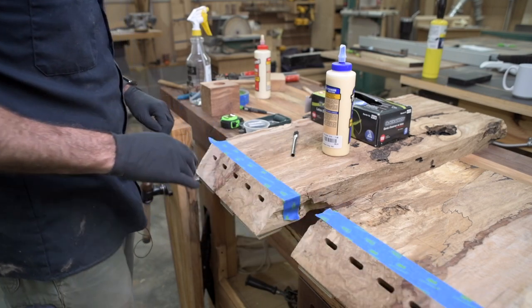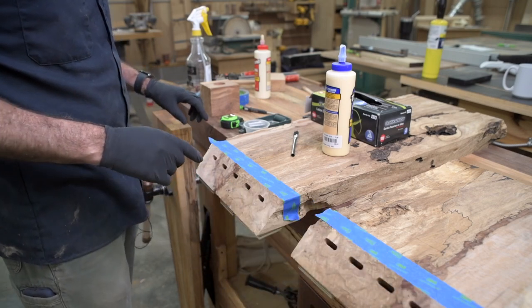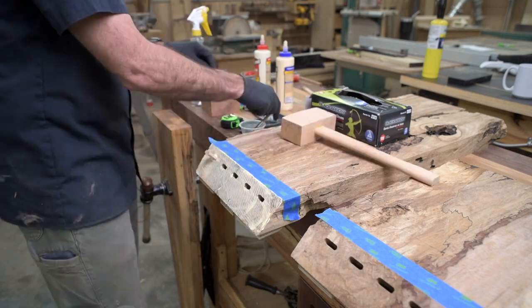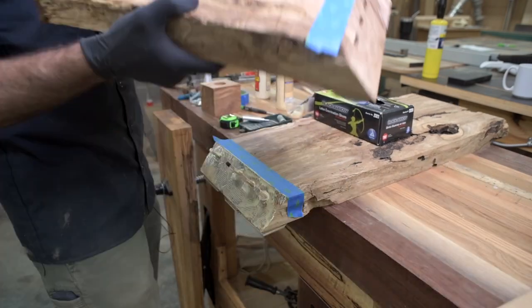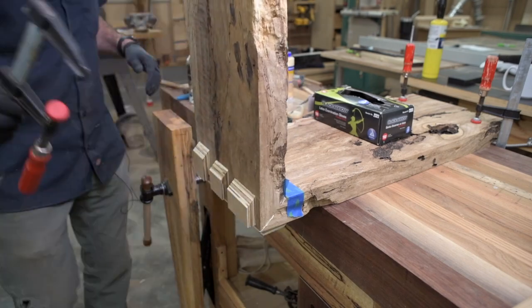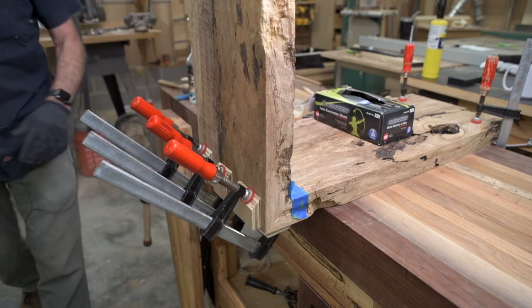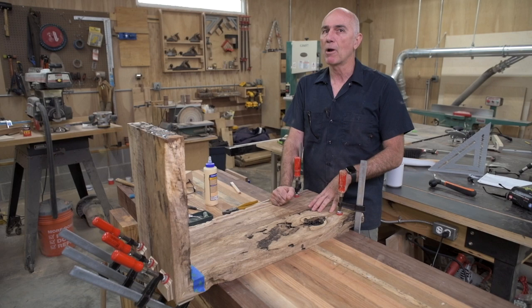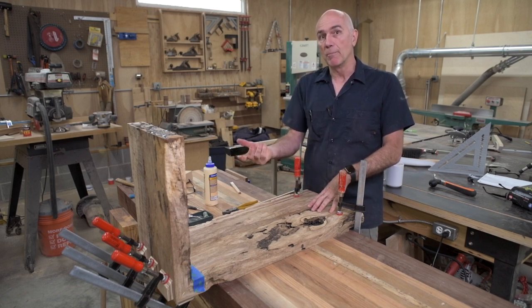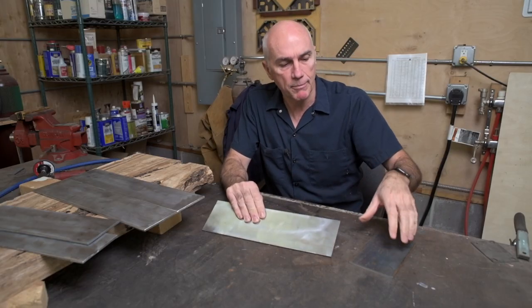I've got some tape here ready for the squeeze out. I'm going to skip one of the dominoes because I misaligned one of the holes. The metal for my legs is outside soaking in vinegar — I'll leave it there until tomorrow. That will get rid of all the mill scale and make it a lot easier to grind and weld. I prepped this material by soaking it in vinegar for 24 hours over the weekend, and it works amazingly well.